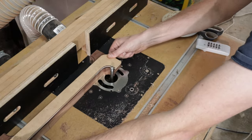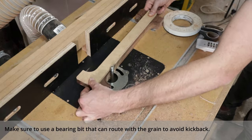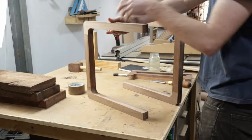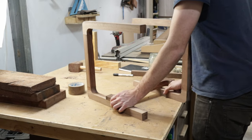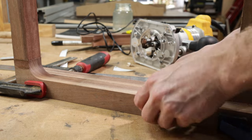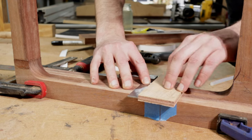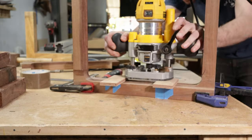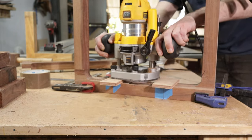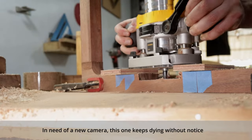After bandsawing off the bulk of the material, it's back to the router table to finalize the shape. To cut the rebate in the legs, I'm using painters tape and hot gluing on some plywood scraps for my router bit to run against. In hindsight, I really should have used CA glue or super glue or even double sided tape as this hot glue flexes a little bit. I should have also attached a bigger plate on my router base — this is pretty precarious. Luckily I didn't have any issues, but using a larger base would have been a much more sensible thing to do. You can see the issue with the slightly flexible hot glue — it didn't turn out to be an issue, but it definitely could have.